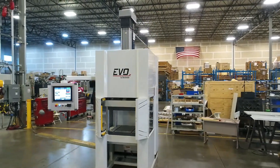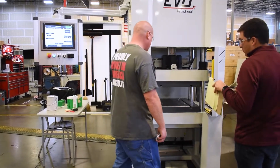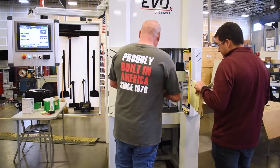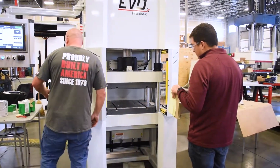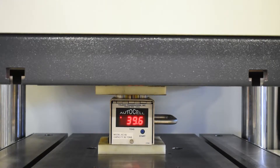Whenever we're testing and setting up a servo electric press like this, we independently verify all of our readings. In terms of the force, we have the press set up to measure force, and then we bring in a second load cell and match it at different points — probably 8 to 10 different points in the cycle, multiple times — to make sure that the numbers we're calculating with the press are actually being measured out on the test equipment.